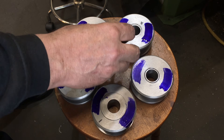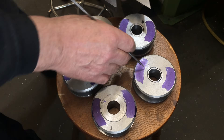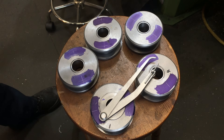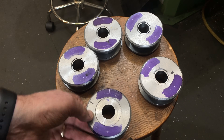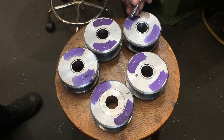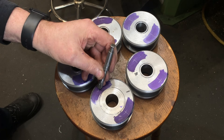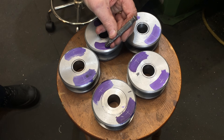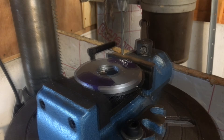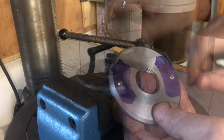After turning the washer round in the jaws I put a little decorative chamfer on the outside edge. Now to tighten the threaded washer onto the arbor body I marked out for a couple of blind holes to be drilled into the washers. Each grinding wheel must have a blotter between the arbor faces and the cutting material to provide grip and to reduce damage to both the arbor and the wheel. The tightening tool was made from a length of 5 millimeter bar bent in half and then the ends bent at 90 degrees, providing a simple two-pin spanner that won't easily allow over-tightening.